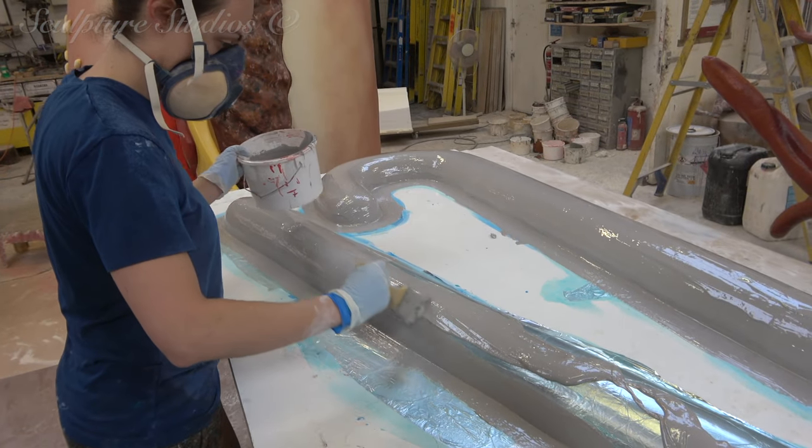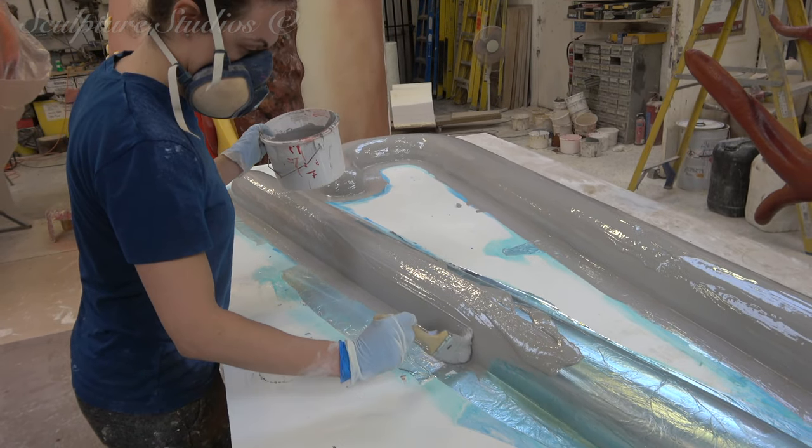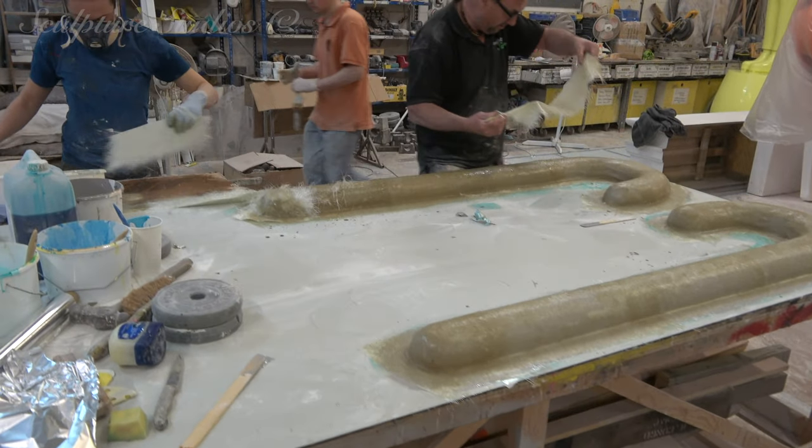These polystyrene patterns were coated in a water-based plaster mix — a material that you might find in home construction stores to help fill any blemishes on your home walls. We then sanded this down to a smoother finish in preparation for mold making.